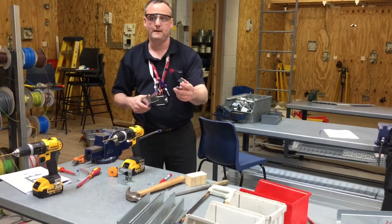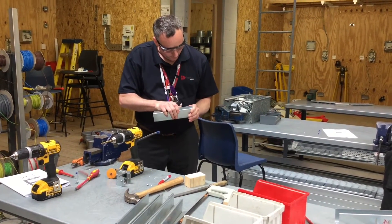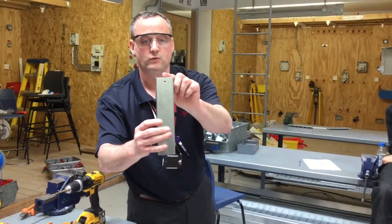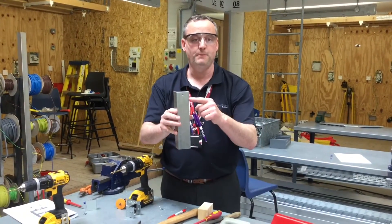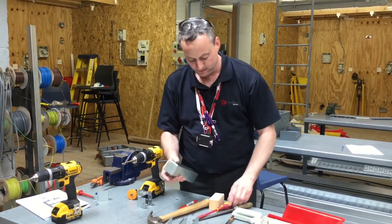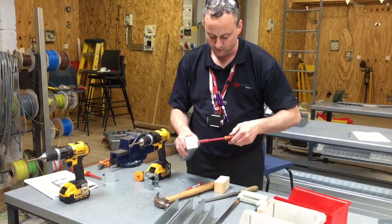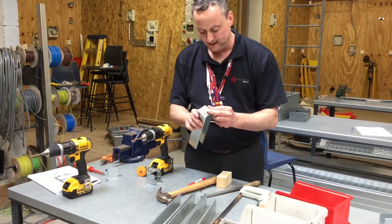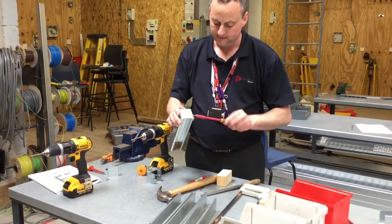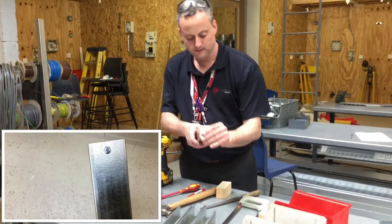End cap — making sure the flap is at the back, compared to the trunking. It might be slightly squashed now that you've drilled it. Offer it down and into position. We can see that the holes line up. We're now ready to put the bolts in the end of the trunking. They're all lined up and ready to go. Into position, making sure the end cap is flush with the end of the trunking. Tighten the bolts in, nice and firm, on both sides. It can be slightly tricky depending on the position of the hole. And there we go — end cap set.